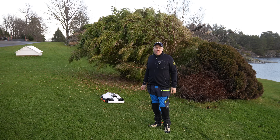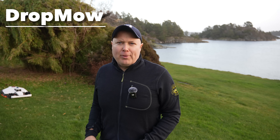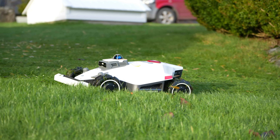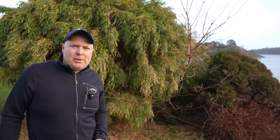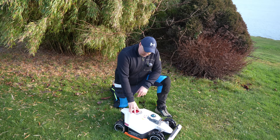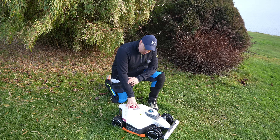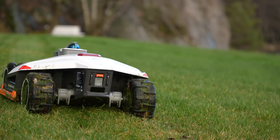Now the Luba 3 is ready for mowing — it's fully charged and the firmware is updated. A new feature on the Luba 3 is something called Drop Mow. You can place the mower on your lawn and press a button, and it will start automatically cutting without mapping out zones. This is perfect if you want to lend it to neighbors or bring it to a vacation home. Just push and hold the mowing button for five seconds, then hit the start button.